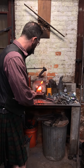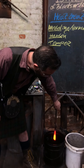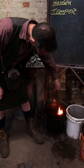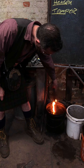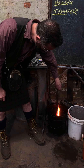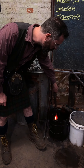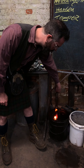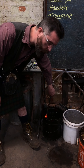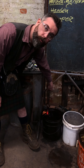That front end got a little warm but for this application I'm not too concerned. We will get into the conversation about grain growth — if you get your material too hot you're going to get grain growth and all kinds of different little problems which may cause increased likelihood of failure in your tool, generally chipping.